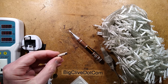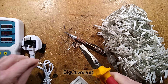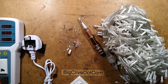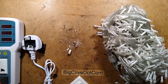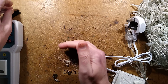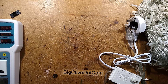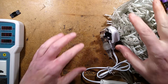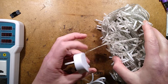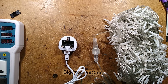Let's get a pair of pliers and see if there's sand inside the fuse, which there should be to ensure it breaks in a controlled manner. There is sand — that's a doubly good start, although the 3 amp fuse would have been preferred. That's a UK thing — we've got very high power available from wall sockets, basically 240 volts at 32 amps, which is the equivalent of about 8 kilowatts from the circuit, typically about 3 kilowatts with a 13 amp fuse. Before I go any further, I'm going to change the fuse to the 3 amp one.